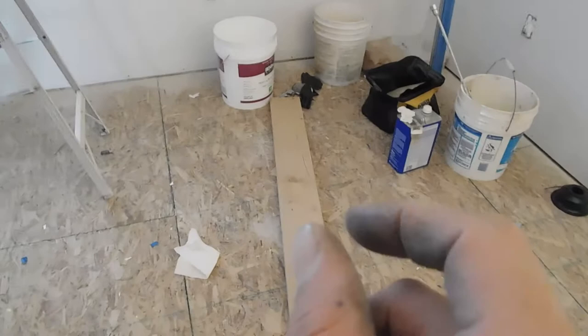But I'm gonna go ahead and attach it up in here. Now, depending on your framing, or if it's a flat floor, you want to make sure you hit your joists. I got a truss. Trusses are here and here, but before the drywall went up I put blocking every 2 foot in here. Now, if you don't have that, you could put some drywall anchors up and glue and screw a block up and let it dry. It will hold the box beam just because they're not that heavy. But if you can hit wood, you want to hit wood.